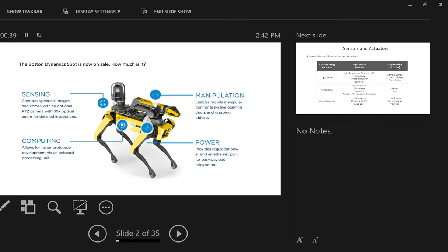You definitely need more than one CPU sometimes to communicate with the sensors and actuators. So definitely you need an operating system on that microcontroller. So Arduino cannot work. You need a better microcontroller, which has a larger RAM to host that RTOS, right? Real-time operating system. And we'll have some examples later this semester to work on that, because there are many interrupts to be handled.